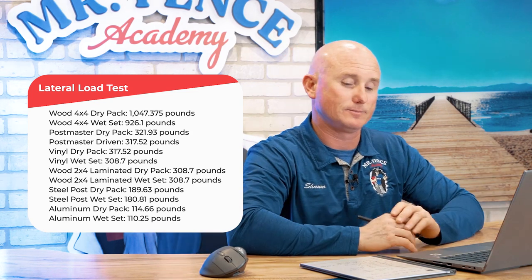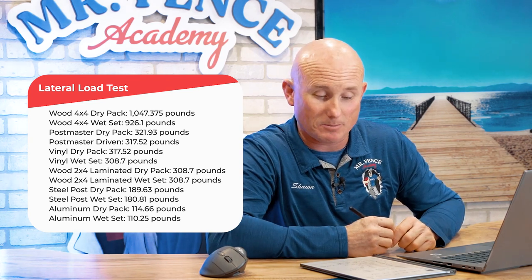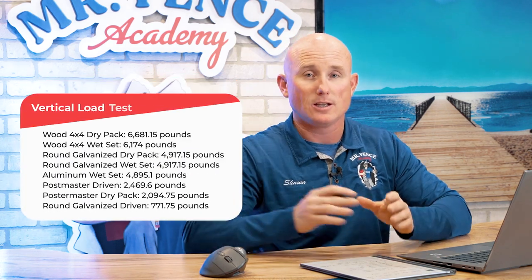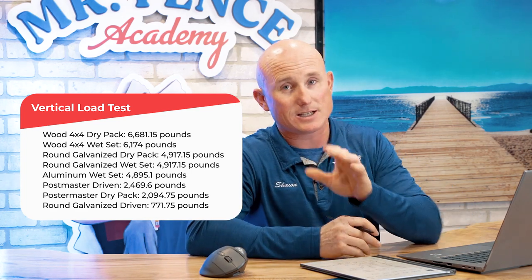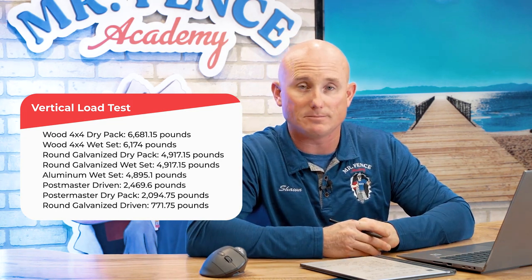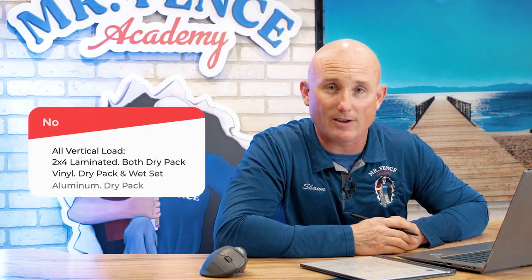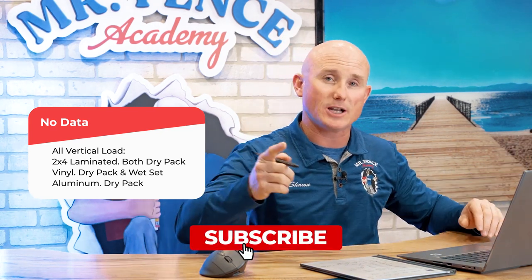What does it tell us? I think that proves the point that whether you wet set or dry pack, they're both going to equally perform and exceed the post capabilities. So whether you properly dry pack or you properly wet set, the deficiency is really going to be in the post itself and not in either one of those applications. What we did not test was dry setting, and that is not compacting the concrete, just dumping a dry bag in there and shaking the pole and adding some water. So maybe the next test is we start experimenting with dry setting and see where does that fail and does that exceed the post performance. So there it is, mystery solved. Magic concrete, dry pack for the win.